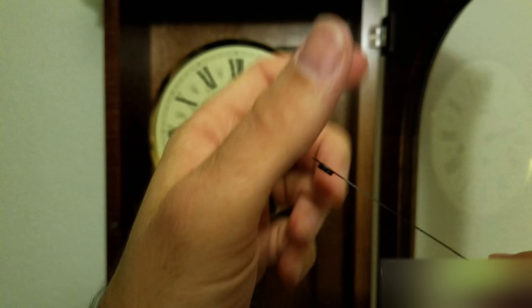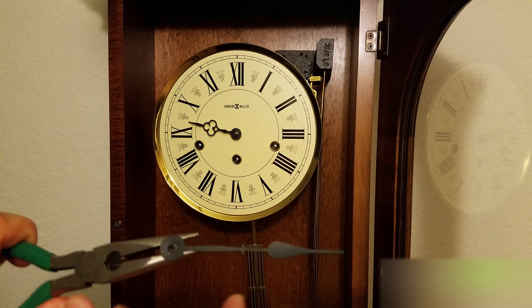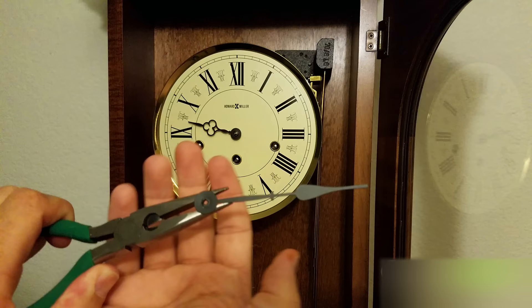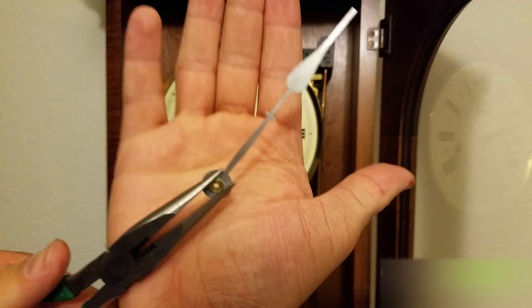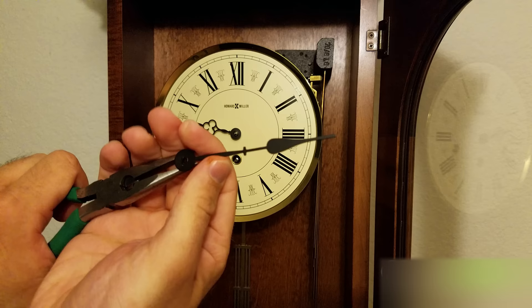Fixing this is really simple — grab your needle nose pliers. Now if this is a clock that you can't find a replacement hand for, or it's really old, you'll want to get pliers that are protected with rubber tips on the end. You'll basically put the hour hand on your needle nose pliers like so, just pretend it's on a minute past the 15, hold this real tight, and just push that up a little bit — it's done by pressure, it's not going to break it.